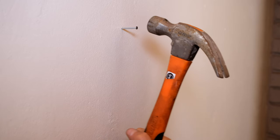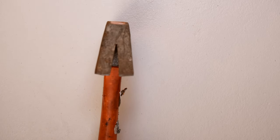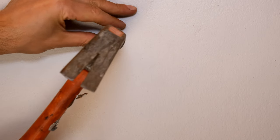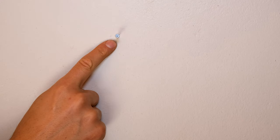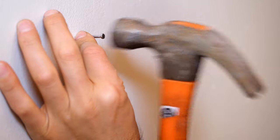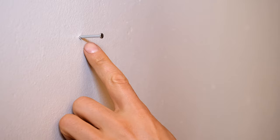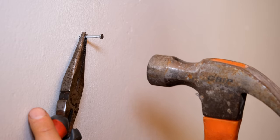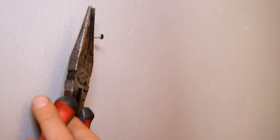The hammer has to go directly onto the head of the nail. The best way to do that is to stand directly behind the nail. If you're trying to do this at an angle, there's a very high chance the nail will go skew and eventually pop out. You can see I'm holding it and hammering it into the wall. Check that it is going in straight — the nail should be exactly horizontal. If you're worried about hammering your fingers, you could hold the nail in place with long nose pliers.